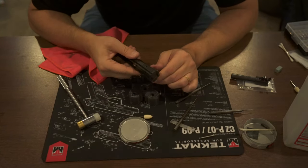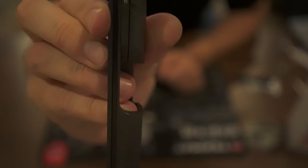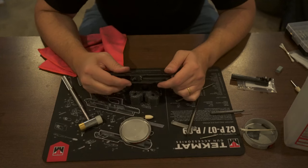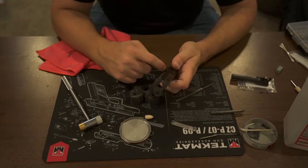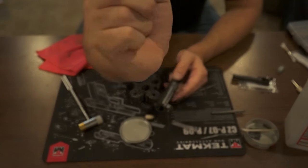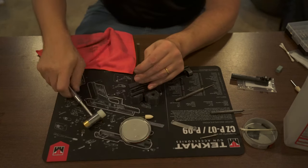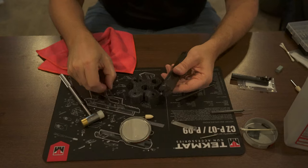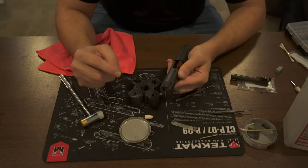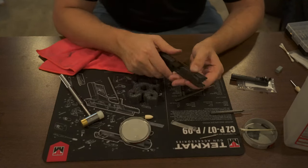What you're trying to do is get the pin to where it's equal on both sides. Gentle taps — I'm not beating the heck out of it. Put your one-eighth-inch punch in, slide your fingernail down to where it makes contact with the serration to check your depth, and do the same on the other side. I'm going to give this one last little love tap — we're there. Check your depth on both sides to confirm it's equal, and yeah, we're there. That's it — that's all there is to doing the slide.